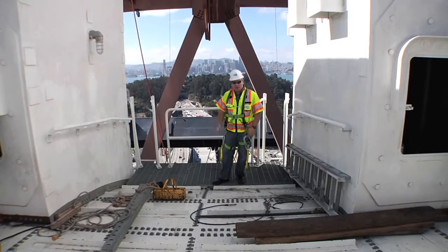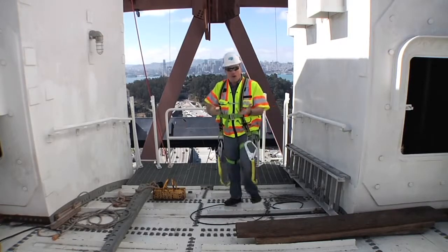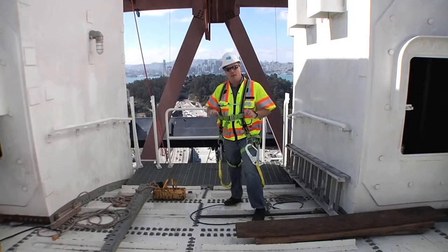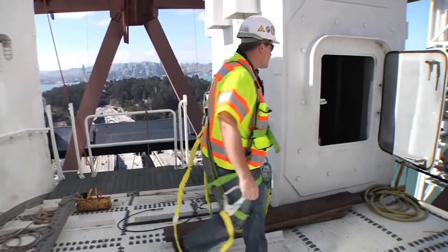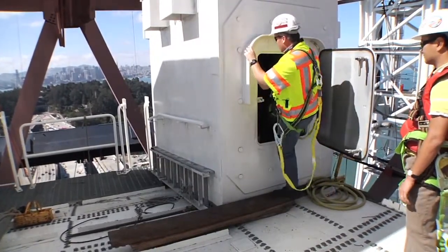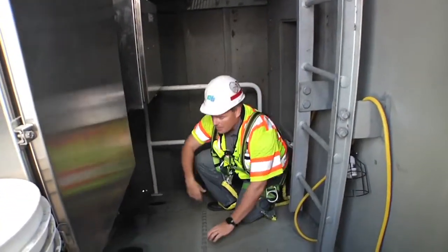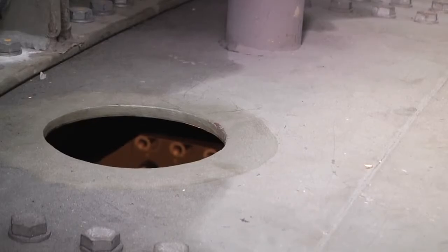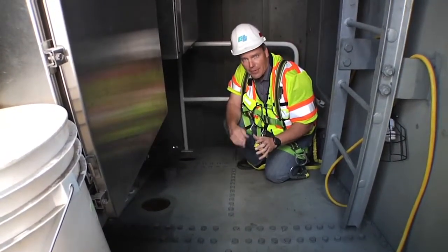Everything's exposed. So what we do is we use dehumidifiers. Big, almost like air conditioning units that suck the moisture out of the air and out of the area where the steel is. Follow me, I'll show you. All right, now I'm inside one of the tower legs, right above the main saddle for the main cable of the bridge. And you can see where I'm pointing down here, these holes have been cut into the chamber below where the main cable is. In that area, we don't have the wire wrapping around the outside of it.